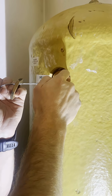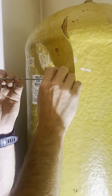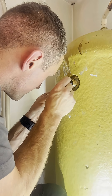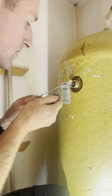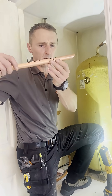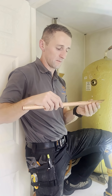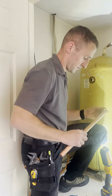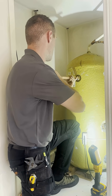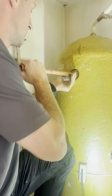There's a compression fitting here, and then a slightly larger thread for this, so we're going to push that over the edge and just slowly wind it until we find the thread. And then you are ready for your connection — so we've got here a little bird's beak we've cut, which will stop air being drawn into your hot feed for your shower pump. We will just push that over there, and then push that onto there.